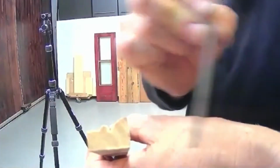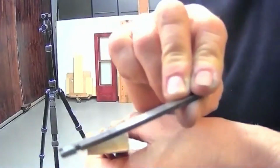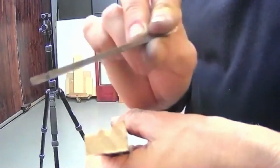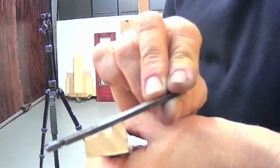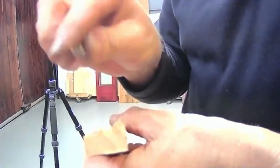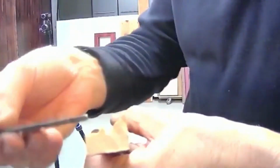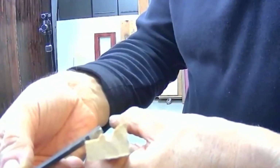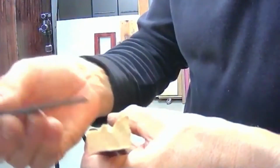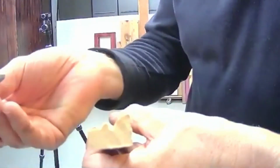It'll actually be longer so I can clamp it, and I will plane it at an angle. I'll put a mark on here using a bevel gauge of what angle this is, and then I'll just use a jack plane to remove material down to that angle. Then I'll do the half round with a fence, do the beading cutter with a fence, and then I'll have the bead and an angled piece over here, and then I can use a rabbet filletster, rabbet plane, plow plane, combination plane with a plow blade and a fence to plane that off flat. So that would make this profile.